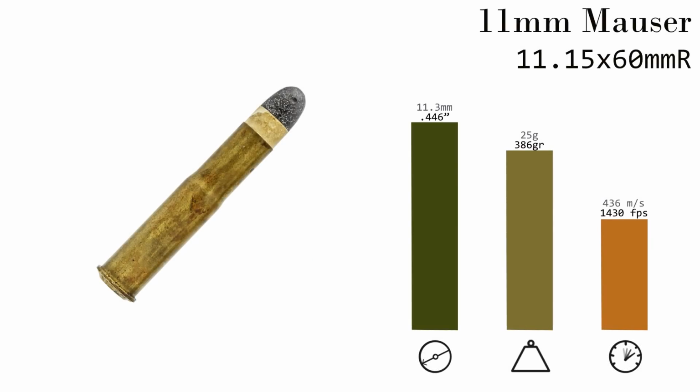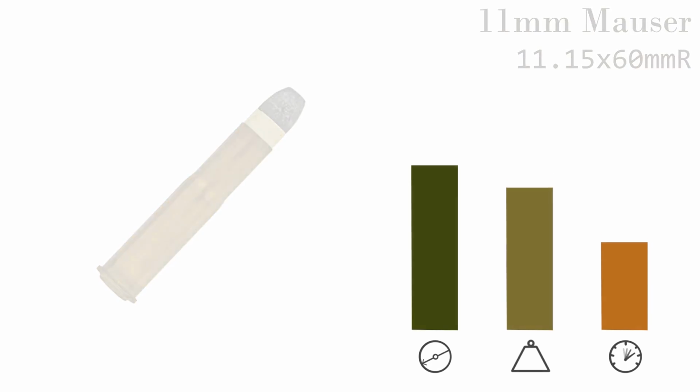You see, the original 71 cartridge had a shallow primer cup and a round-nosed bullet. Right away, they set that primer deeper in. This was done by the time the rifle was adopted. The next year after, that bullet tip would be flattened, and these two measures seemed to have solved the issue. Production of the new ammo, however, would take a couple of years. They were busy consuming the already produced 11mm, and I guess consuming some rifles with it.